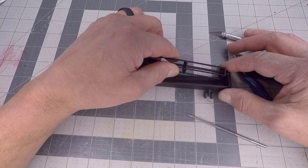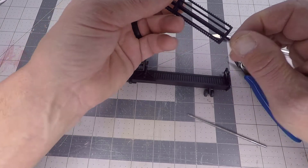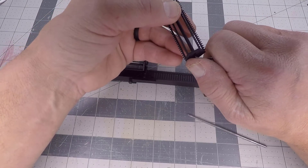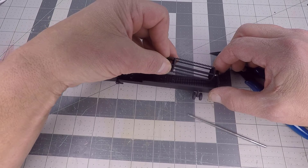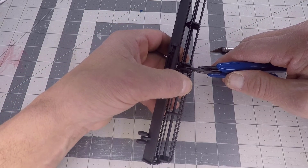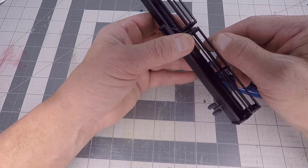Again, test fitting. I see right here we have a little protrusion left over from printing — we'll scrape that off. And while we're at it, we'll just scrape some of the other paint off; that'll help reduce the circumference of that rod. Test fit. And we have a nice smooth assembly. Now we'll go back to the center arm with our side cutter and cut that rod down so it's about halfway through the center arm. Gently pressing against the outside arm, and here we are.